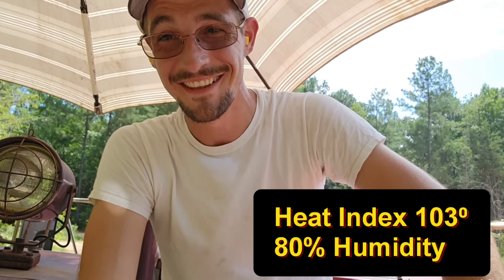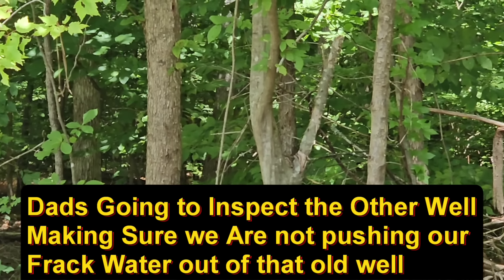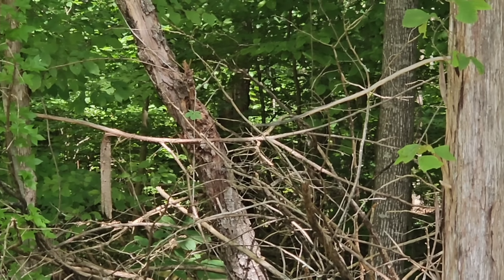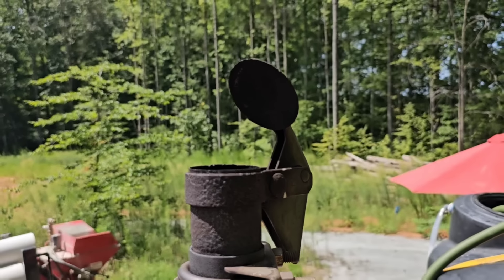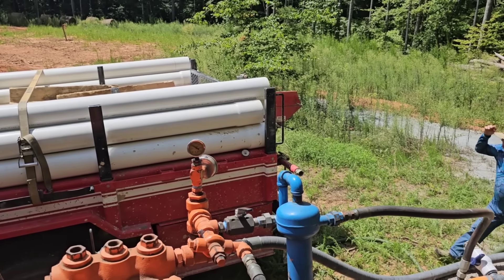Pressure went from 1,700–1,800 down to 1,000 psi. Dad's going to inspect the other well, making sure we are not pushing our frack water out of the old well. There was a reason I set the packer at 100 feet — my expectation was that all of the old wells were no deeper than 100 feet, so we wouldn't have any issue with that. It officially just busted after about 10 minutes of pushing on.